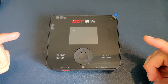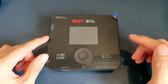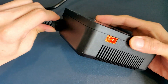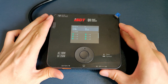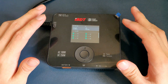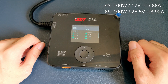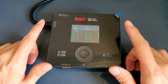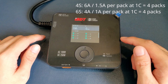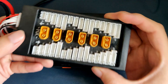So why is this the best beginner charger? Well, mostly because it solves all the aforementioned problems. The ISDT D1 comes with a power cord which you can just plug into the charger. With the AC in — that's the wall power — you get 100 watts of charging power, which means you can charge 4S batteries at around 6A, or 6S batteries at around 4A. Assuming you're doing parallel charging at 1C, that's 4 packs in 1 go — for both 4S and 6S, that's around the amount of batteries a newcomer will go for, and it just so happens to fit nicely in one parallel charging port.